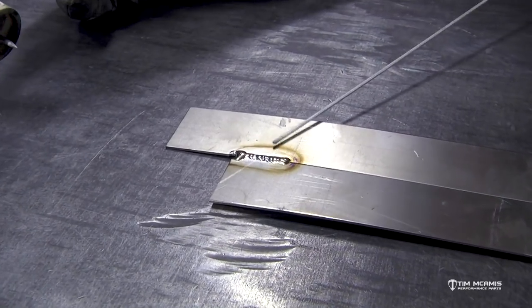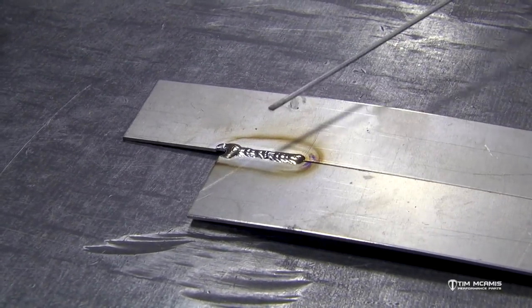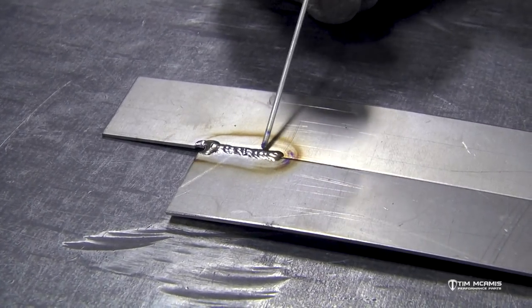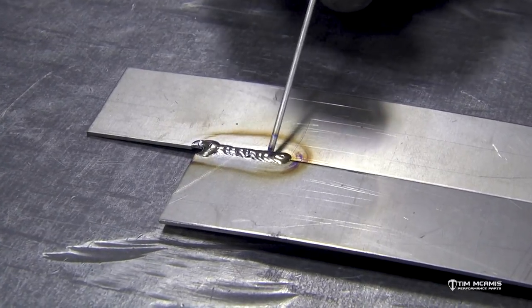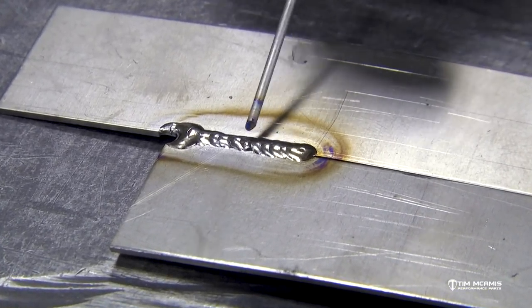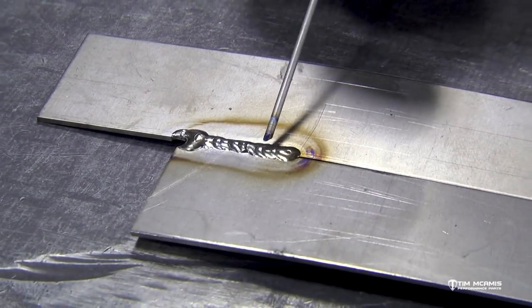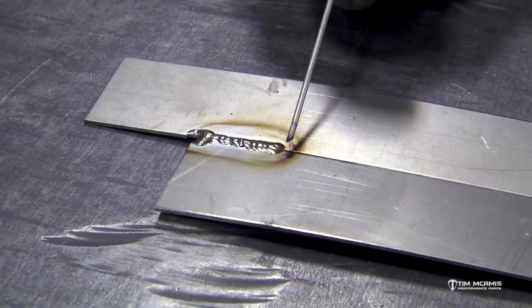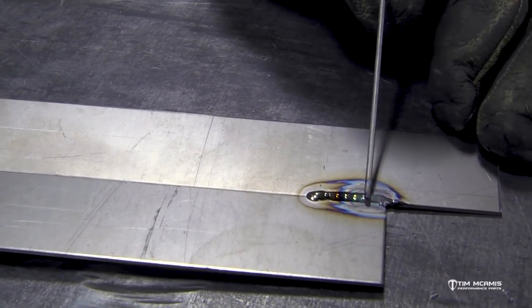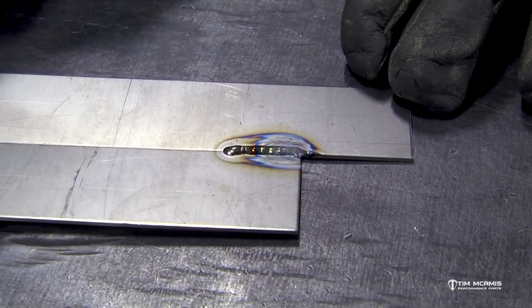See the difference in it? There's obviously a ton of difference. I still went pretty fast but you can see the coloration in the weld looks good and I kind of got more stabilized down here. The puddle is pretty consistent, and you could actually hear the pop of that as I was dipping the rod in — you could hear it just ticking as it went along each puddle. This is what we're looking for right here. This one is a bit jacked up — I was going too fast. But this has got good coloration, a little tiny bit of nickel color to it which is fine. You're looking for this type of finish — almost a polished or chrome finish, not much heat in there. You can see there's hardly any heat around this at all. Whereas over here it's totally different — you get some real cloudiness, it's too hot, not enough argon coverage, and that's not what you're looking for.